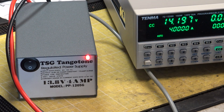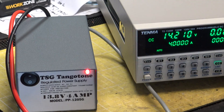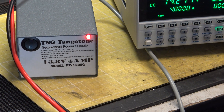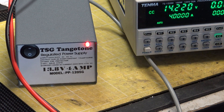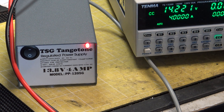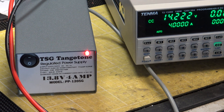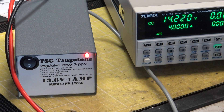So this is part four. Part five we're going to put some more together — that's the prototype, and this will be in the next few weeks. So we've got ourselves a power supply. It's a little bit more compact than the original but a little fewer amps because we've been replicating the five-to-seven amp circuit. The three-to-five circuit I don't like, so I'd rather put the five-to-seven board in any power supply we're working on. We're going to be doing some other power supplies — I think we might replicate a Bremi because somebody likes the idea of an adjustable internal voltage. We're also going to be doing the Citizens Band magazine December 1980 three-to-five amp power supply project — I built one and used it for 20-odd years.